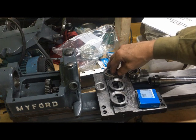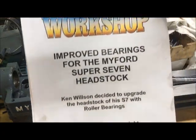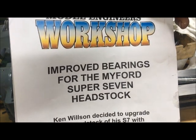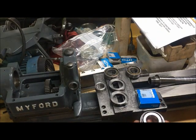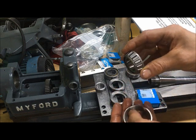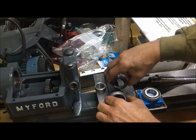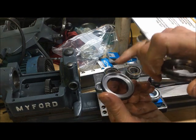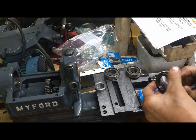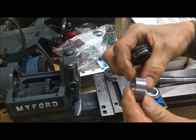These angular contact bearings are okay enough, but then I came across an article which talks about replacing these angular contact bearings with tapered roller bearings, which as the article suggests provides a stiffer arrangement and also easier adjustment. The article describes how you just modify these lock nuts so they are not interfering with the new bearing design, and then make a new, slightly shorter distance piece.